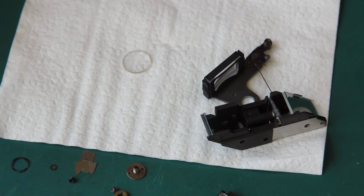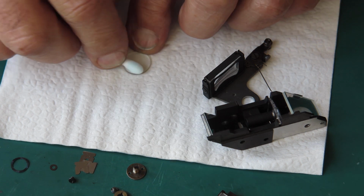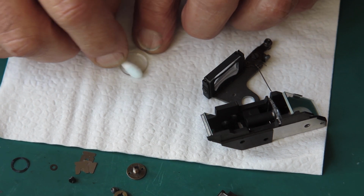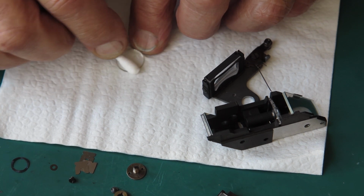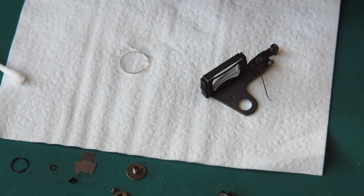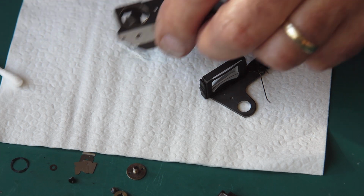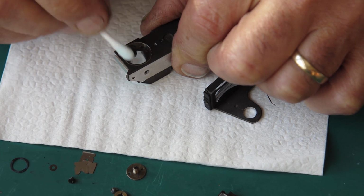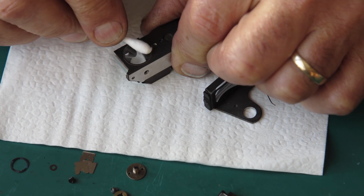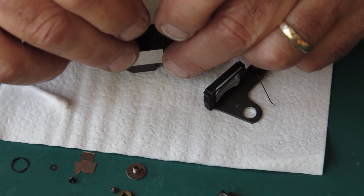So there aren't many other pieces of glass in the rangefinder to be concerned about. Here's the eyepiece lens here. I'm just cleaning that. This is the convex surface, and the convex surface goes inwards on the rangefinder. So having cleaned that surface, I can drop that into place. And the flat surface is outwards here, and I can clean that in position. And put the retainer in place.